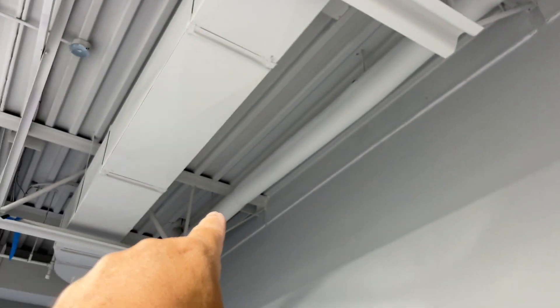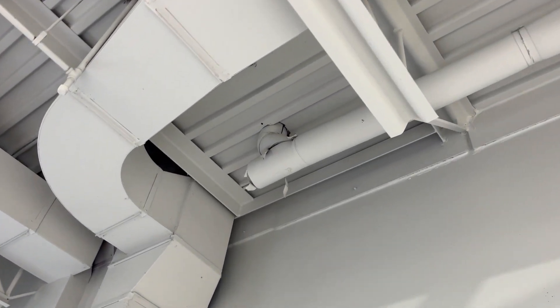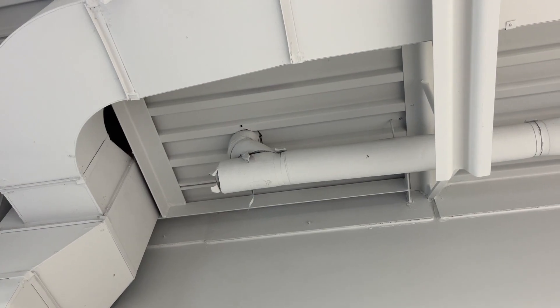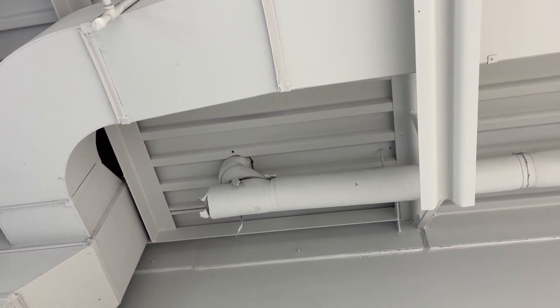That's where the roof deck overlaps, and if you follow those back, they go right to that drain there. Now this is not a new leak. This was leaking two years ago and I resealed underneath the membrane, which is under the compression ring. Obviously the product that I used is not holding up — it's leaking again in full fury, so I have to go and do it again.